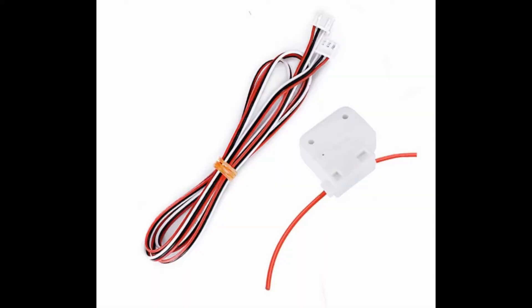This is the run-out sensor I use that has a three-pin connection on it. You will have to switch the white and red — the power and sensor connection — when connecting to the back of the TFT, because when I did a direct connection it was actually pausing the entire system. The system wouldn't go into pause — it would just stop. The power would stay on but it was completely frozen. Once I switched those around it was fine.